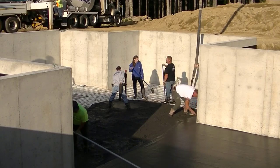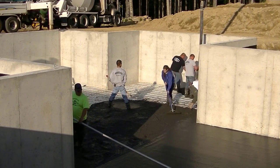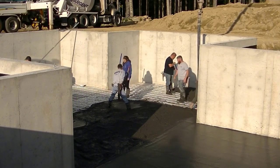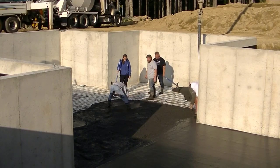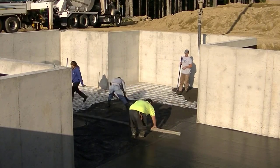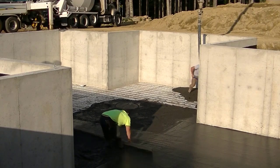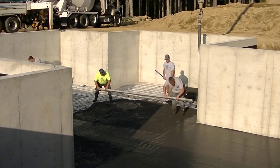You can see Darren's moving the hose back and forth in about a four-to-five-foot area as he's moving forward, so the guy puddling behind him can rake it smooth and get it as level as possible. Using a laser to pour your floors — that's really the only way to do it now. Especially if you're doing wet pads, it's basically a one-man or one-woman operation when you have a laser, and it's very fast if you know how to use it. We want to screed down the rest of that first truck before we dump most of that second truck.